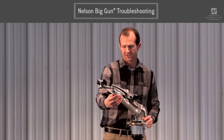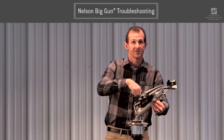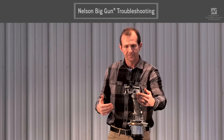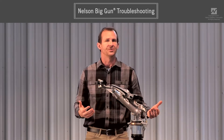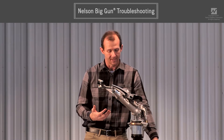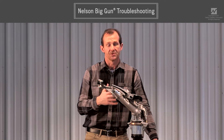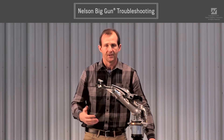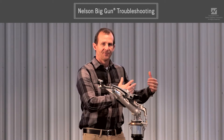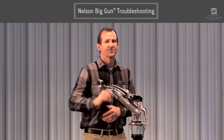The first issue that needs to be addressed is that of slow drive — the actual rotation speed of the sprinkler around its center axis. If after years of operation a gun is moving very sluggishly, the first thing to check is adequate pressure at the sprinkler. Use a pressure gauge or pitot tube near the base. Many times people report problems and say they have 40 or 50 psi, but that reading is back by the pump several hundred feet away. That pressure is much less at the gun, so it's very important to find out what that nozzle pressure actually is.